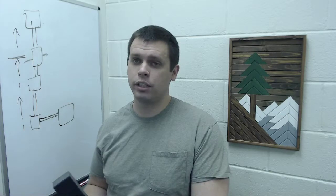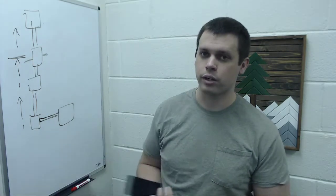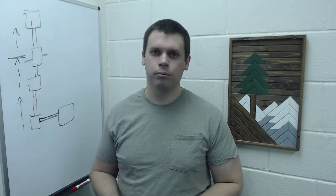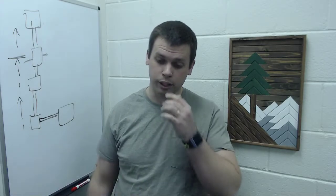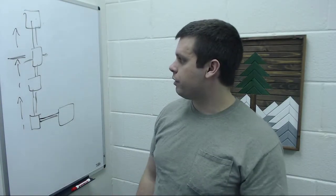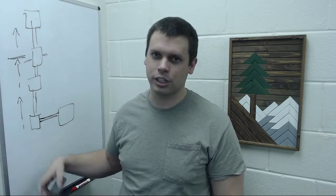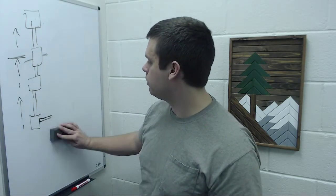If you're going to send and receive data reliably, you're going to need to use hardware, like a hardware serial port. And those Nanos only have 1. The Megas have 4, which is great, but they were too big to fit in the actuators. So I spent quite a while trying to figure that out, and again, not really knowing much about the technology, I assumed you can just connect them all to these 2 lines, but come to find out that it doesn't work like that.